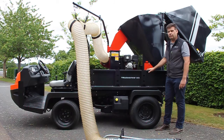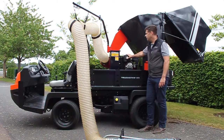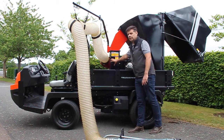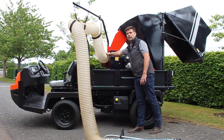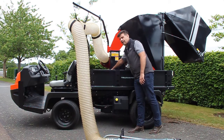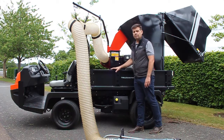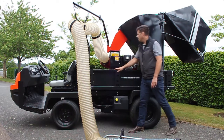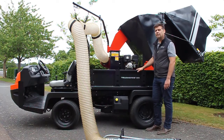From a maintenance point of view it's very minimal — it's routine maintenance on the engine and the fan assembly. On the fan assembly we have a quick release on the hose with a safety switch, so when you take it off you can't start the engine. In the bottom of the fan assembly we have a bung so when you're washing out, all the material comes out the bottom. That's a quick overview of the T1 — I hope it's been helpful to you and stay safe.